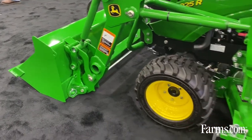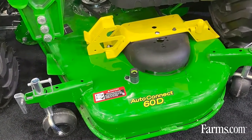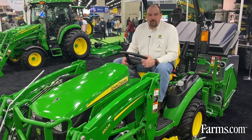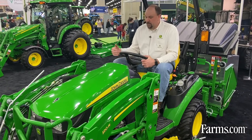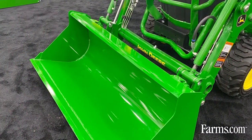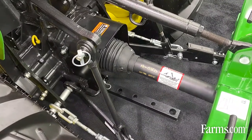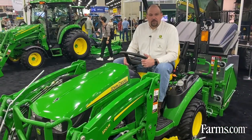That mower deck allows you to mow grass just like a normal lawn mower. It's good for ditch mowing and maintaining large properties when you don't want to use a small mower. The drive-over deck feature allows you to disconnect this mower in less than 30 seconds — pretty much just one trip off — so you can easily convert between using the loader or the mower. The loader itself is also quick disconnect, so if you don't want it out in front while mowing, you can take it off in less than 30 seconds and put it back on in about the same amount of time. In the back is a standard three-point hitch equipped with iMatch, and it also has a standard 540 PTO.